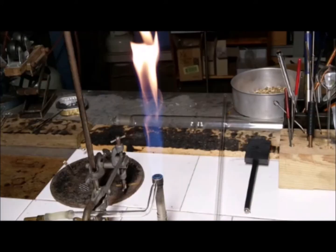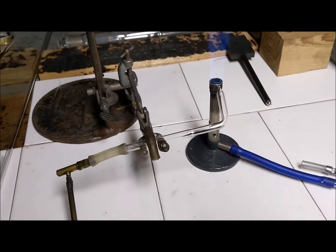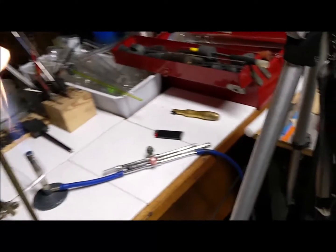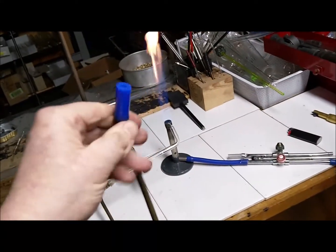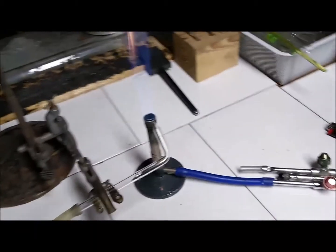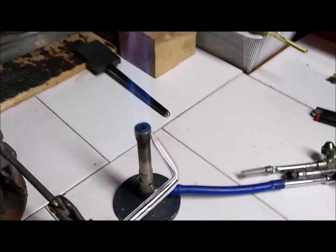I've made a video that demonstrates some basic glass blowing techniques that would suit someone who has no special equipment. I'll show you how you can use some soft glass tubing to make an ampoule and seal something in it using a Bunsen burner and a blow hose. The blow hose is connected to a piece of tubing — I've used a bit of glass, but it can be metal, so long as it's just a small jet that blows into the base of the Bunsen flame. When you blow into the blow hose it'll make a sharp flame.